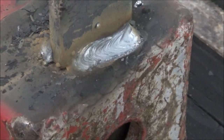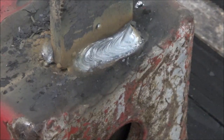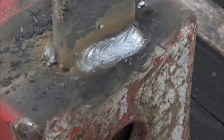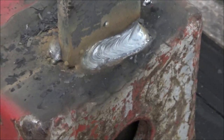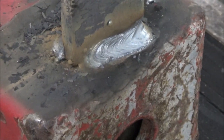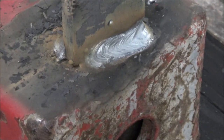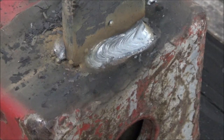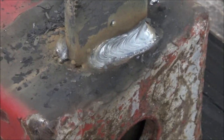As you can see, as it warmed up it got easier to lay the bead in there — that was the same case with the trailer. Once the neck got good and warm, it really welded out pretty nice. Vertical down, didn't even go all the way through or all the way around — it was plate welded — and still more than enough to bend that 3/8 bar. So I think it ought to hold.